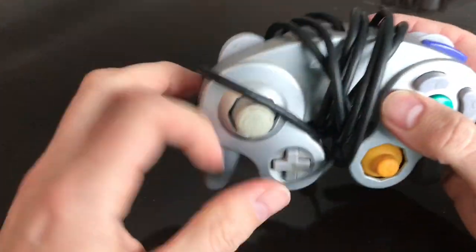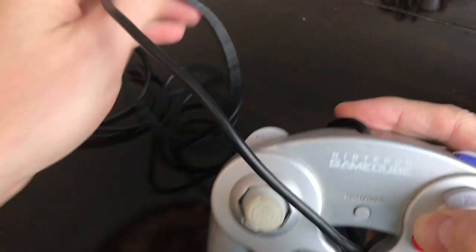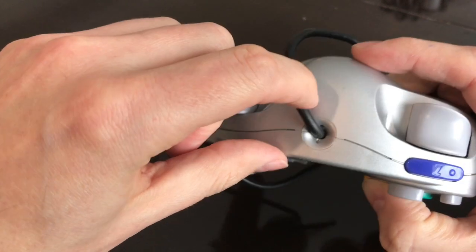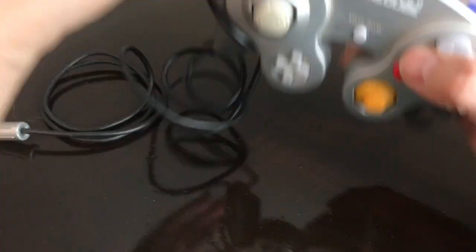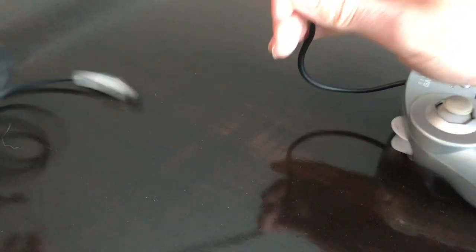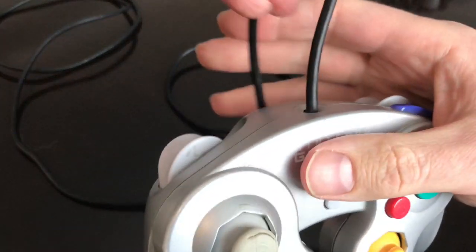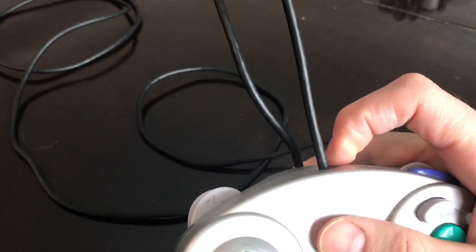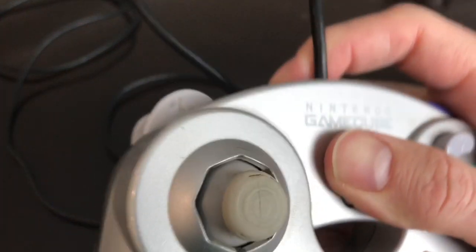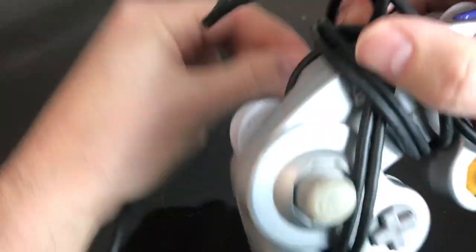Here I found a controller someone had wrapped for me. While I appreciate the help, having it wrapped right around the controller like that puts all the stress right here at the base, and eventually this is going to go - you'll see severing right here as it continues to pull apart. So I'm going to take the cord, straighten it out, and do the same thing. With controllers I don't mind wrapping around themselves, but I make sure I maintain a straight line coming right out of the controller - no kinks or pulling against the grain.